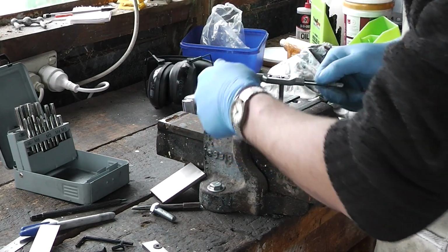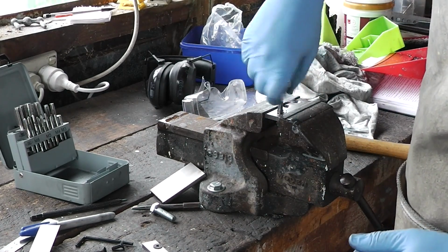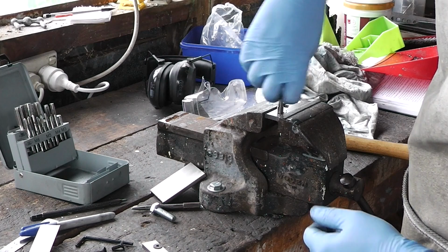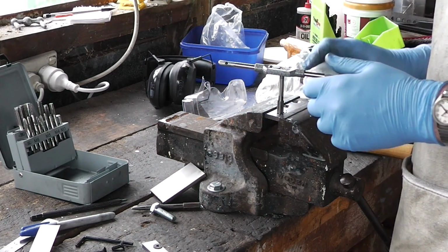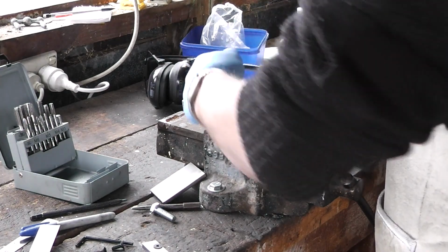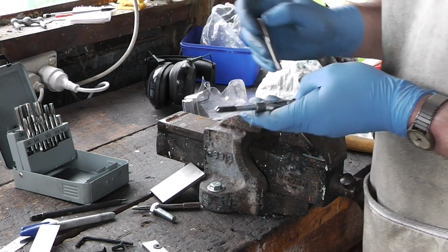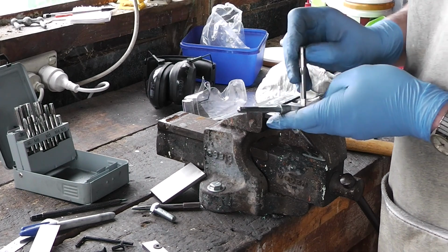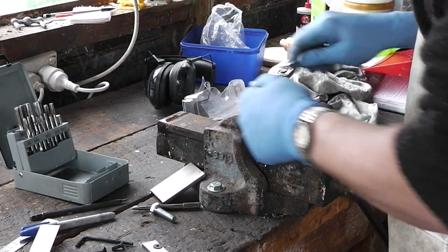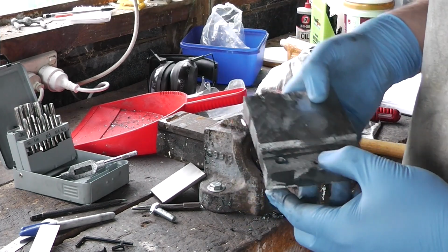With the Zamac I've started to just go straight to the finishing tap, but for this steel piece I'm starting with the 1 then 2 then the finishing tap. Now for the finishing tap. Not often I get to use these big taps. Alright, I just have to drill this hole out to 10mm, back in a flash.